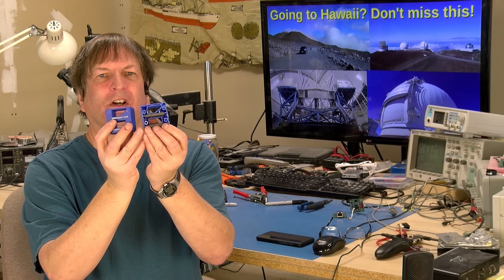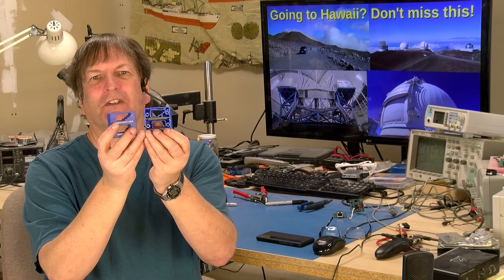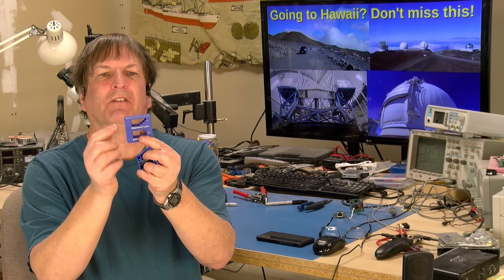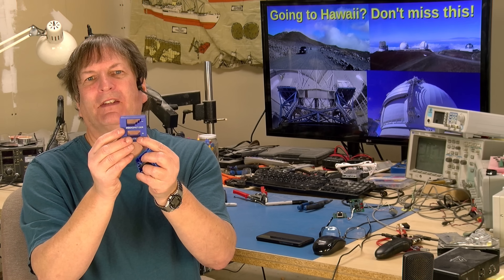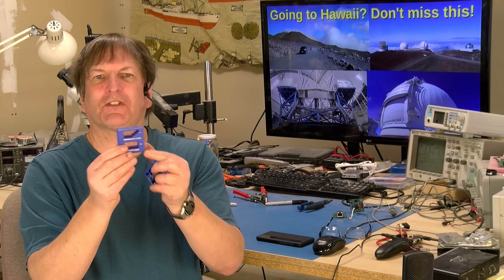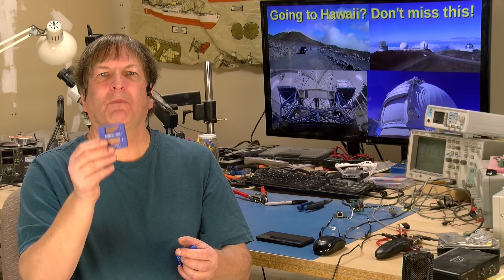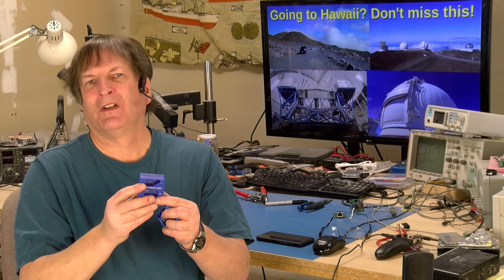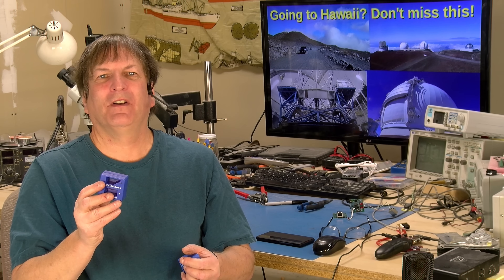It turns out these devices are remarkably effective given how simple their construction actually is. The staircase turns out to be very useful if you're trying to remove almost every shred of magnetic field from something like a screwdriver, although in most cases just sticking a screwdriver through the hole once is really all you need to do. What the staircase does show us is that whoever designed them really understood magnetics and magnetic fields. If you'd like to learn more about the topic, I've done a whole bunch of videos on the subject — there should be a video link floating around somewhere up here that you can click on to watch them. I hope you've enjoyed this video, and see you next time.